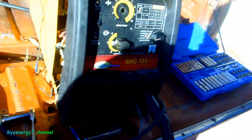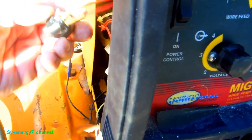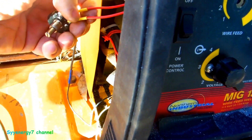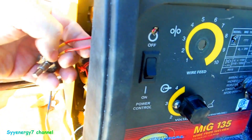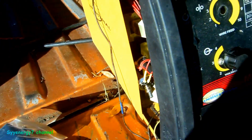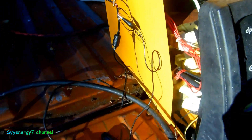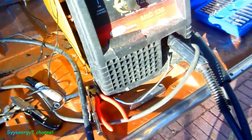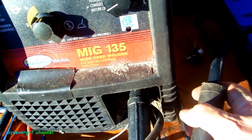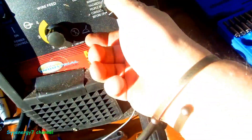And the wire feed works — home free! What I'm going to do is, since there's a nice solder connection on there, I'll just cut these right here and put some black marker on one of these wires to show which one goes where, in case I ever figure out the motherboard someday. I got it hooked up to the 24 volt power supply — it's a 5 amp, made in China. For 15 to 20 bucks this thing will be fixed good. I'm using this rheostat right here.